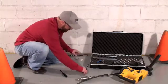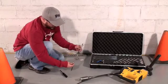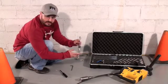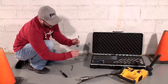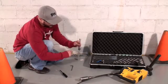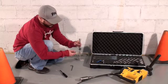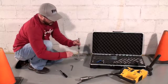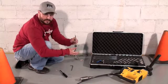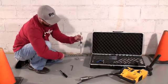I've already put together a complete implant for you — this is what they look like. You have a three-inch stainless steel screen, which is your actual sampling point, and you've got a quarter-inch stainless steel tubing running all the way to the surface. This black rubber plug is used to keep the grout from coming around the sampling port of the implant.